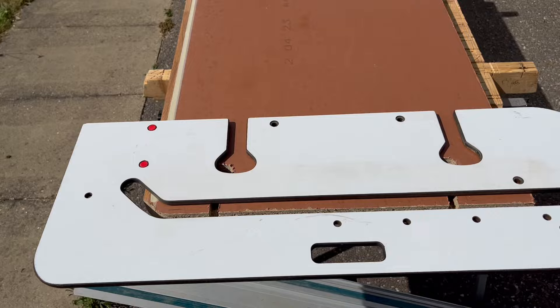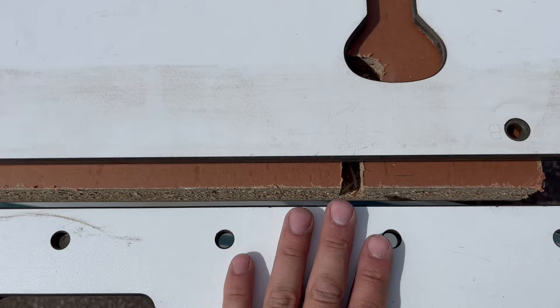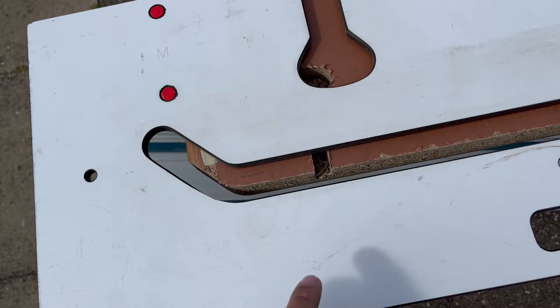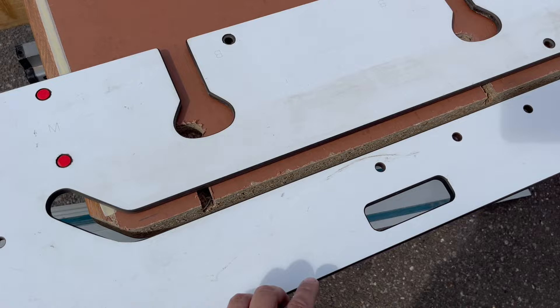Here we are on the bench. We've got a bit of worktop upside down because that's the orientation we're cutting in. You can see I've got these pencil marks on here — I normally put these whenever I do a cut so I know where my jig has been sitting before. This is nine millimeters away from the cut edge, which is your normal offset between the edge of your jig and the side of your router cutter. What we need to do is make this a little bit smaller — I'll move it two millimeters away from that pencil mark.